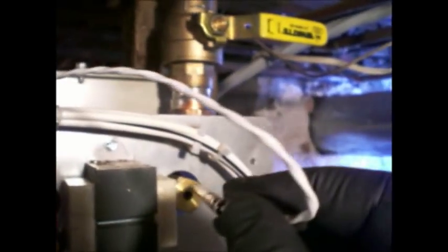Now I can stick the probe back in, which is right here. And the screw doesn't have to be tight because the probe is just checking for temperature. The well is what has to be tight and properly soldered, which this one apparently wasn't. Junk. Alrighty. Put it back together and put the cover on finally. Be nice. Put a cover on, like my dash on my Suburban. Alright. Water on.